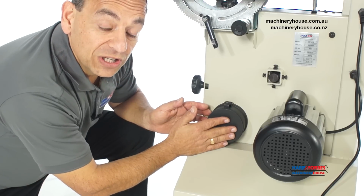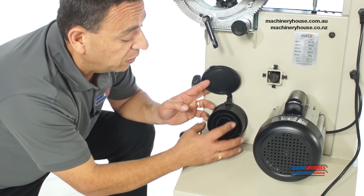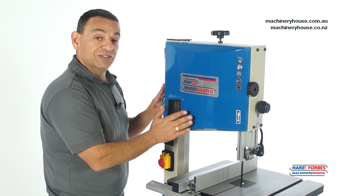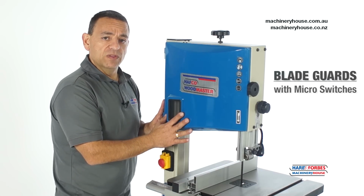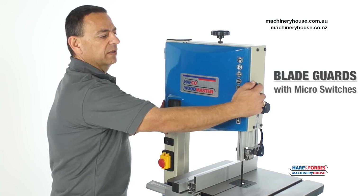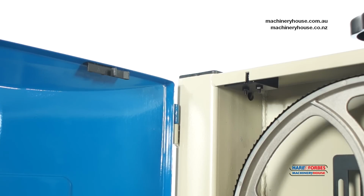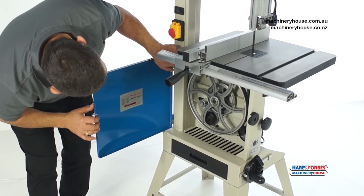At the rear of the machine down below we have an outlet for your dust extraction to connect your hose and extract the dust out of the machine. As an additional safety feature, both blade guards, top and bottom, are fitted with micro switches which actually cut the power to the machine in the event of this blade guard opening. So this one is located up here, and the bottom blade guard micro switch is located down here.